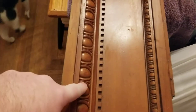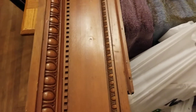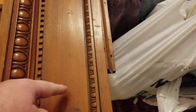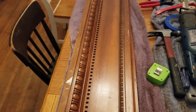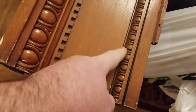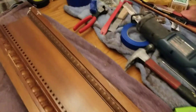The bottom piece — this piece — is the crown, and this is the bottom crown, or base trim I guess. The one that was up there was nailed two ways: it had a nail coming out from the bottom going this way, then one from the back going up — that was an absolute pain to get rid of. These look like they're just nailed from the bottom, which makes it easy. I can remove this lower trim piece and get a putty knife in there.